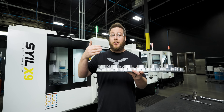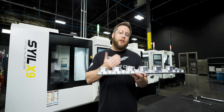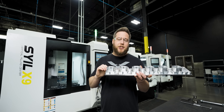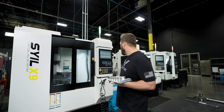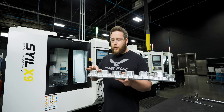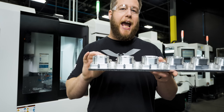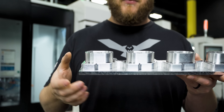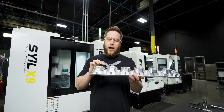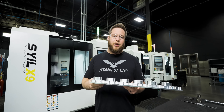Now I can use that same step-over — actually a little bit more. I've added to the step-over: I'm doing 45 thou step-over and was actually able to increase my feed rate because I'm not cutting all this material at an inch and a half deep, so I've got more power available. I'm running 360 inches a minute. Once it roughs this first level, it steps down to the full depth. Now I've only got about a half inch of material, so I can increase my step-over further. On the second depth, broken into a separate roughing operation, I'm taking about 75 thou step-over, which is cutting my cycle time down.